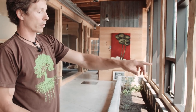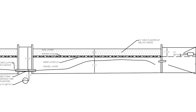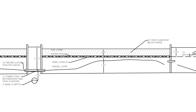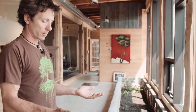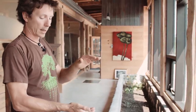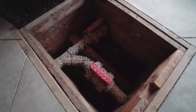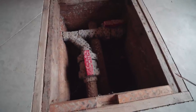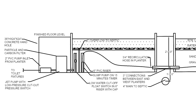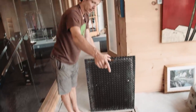The composition of the planter cell is a foot of gravel at the bottom — clear stone — then a layer of fabric cloth, one foot of sand, and another layer of fabric cloth, which helps filter out any particulates. We only use bio solvents so they break down in there, and the last foot is soil for the plants to grow in. The gray water has a shutoff valve so if we need to repair anything we can divert flow to the septic tank outside.